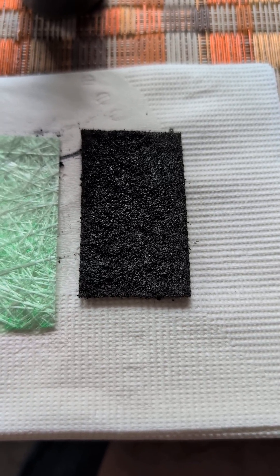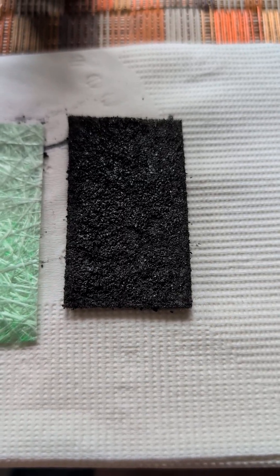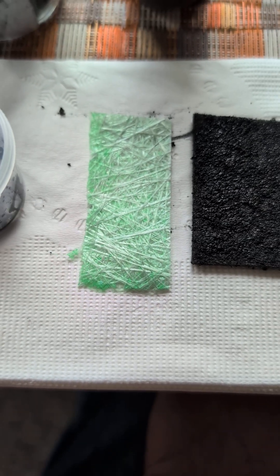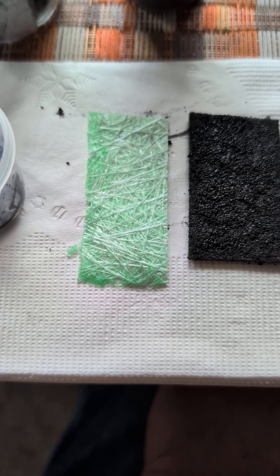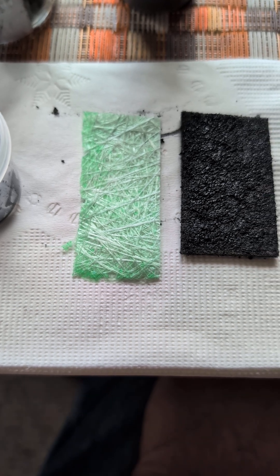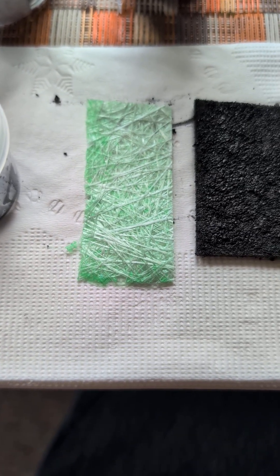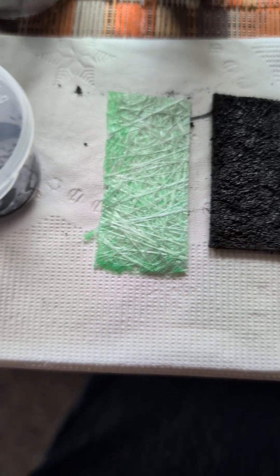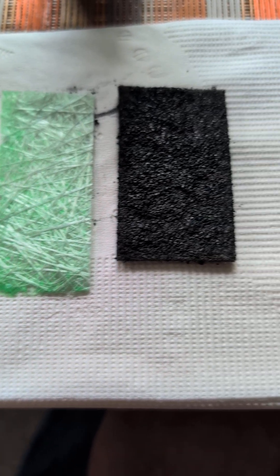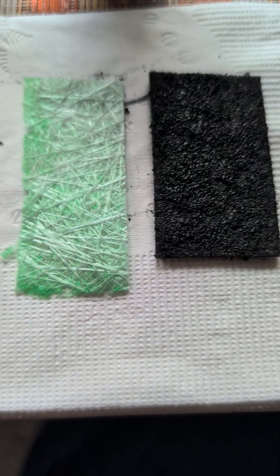More about that later this summer. The other side of the graphite felt will be coated — I use a brush — and we will be using fiberglass mat. This particular one has porosity created by the use of nickel acetate, Ni²⁺, with agar-agar to create a very thin gel, which I applied by dipping the fiberglass felt in that. We don't want shorts to occur, so I want to ensure that the two electrodes will not short. We'll be doing more research on this.